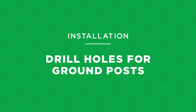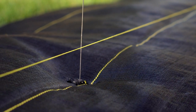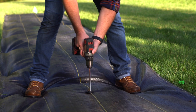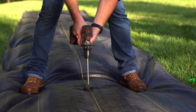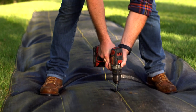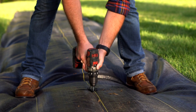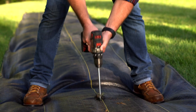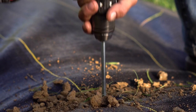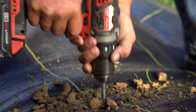Next, using the utility knife, cut two-inch holes at the locations of the two center flags. Remove each flag and, using a drill and the supplied auger bit, drill the holes for the ground posts. Make sure to drill down the full length of the auger bit. Be sure to keep the bit straight up and down — it may help to have someone observe as you drill to ensure the bit doesn't lean, or check the bit for plumb using the included level. Once the holes are drilled to the full depth, it may help to move the bit around to widen the hole slightly.